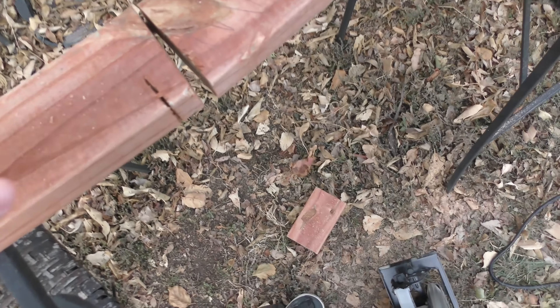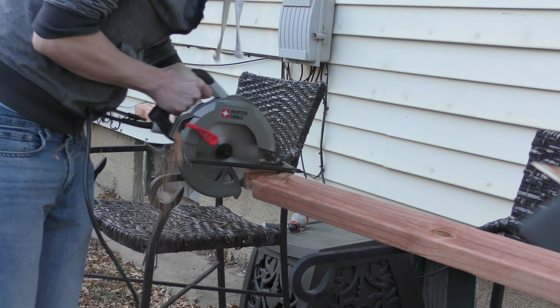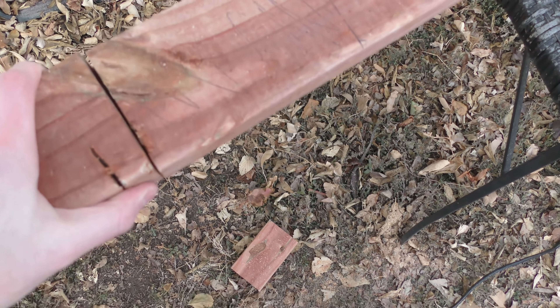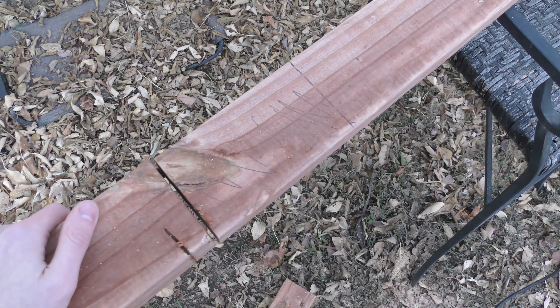I'm not entirely sure what happened there. Cutting along to the end, it didn't cut the very bottom corner and then jumped and skipped back. I think it's because of the way it's balanced — as soon as it gets close enough to fall apart, it jumps and pinches the blade. So after the saw jumped and made that extra cut, the next time I just went real slow, supported the side that was going to fall, and it was okay. The second time it jumped a little bit, but that was the only one that was actually kind of bad.